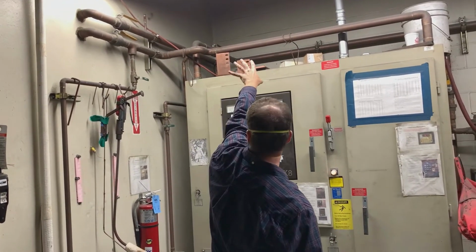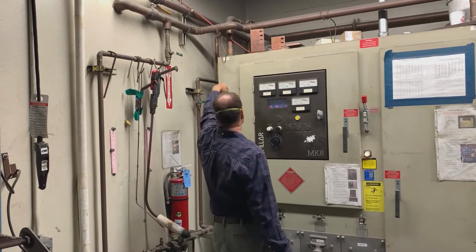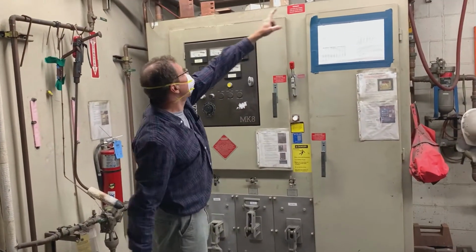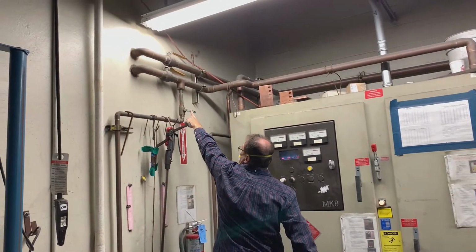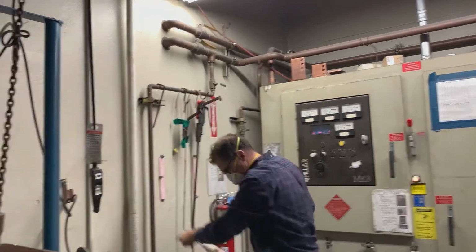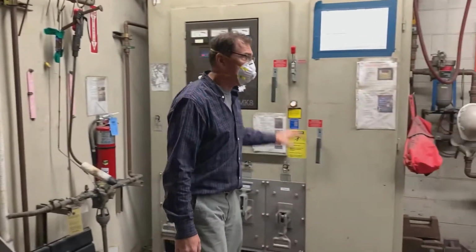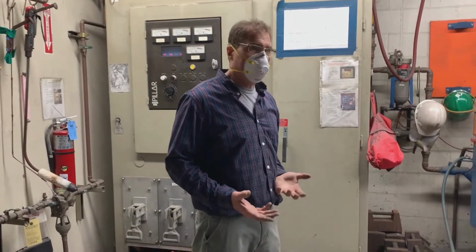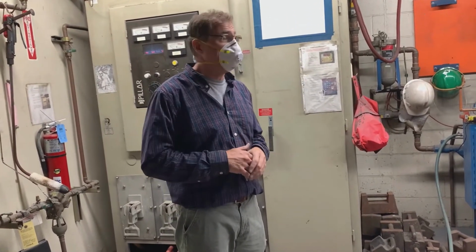Everything yellow up there. So water's going to come up from here into the system, into the cooling circuit, out to the furnace, back in, up and out, and then that's plugged off. You open that valve there into the drain. Okay? So essentially we're putting city water through the cabinet and through the furnace. That's the emergency procedure.